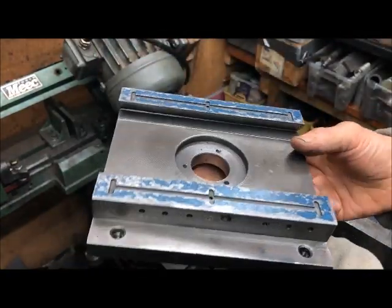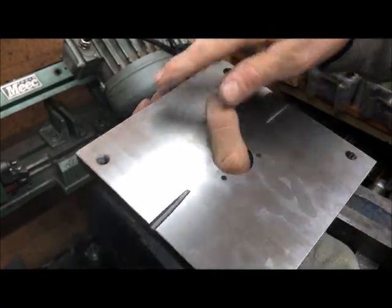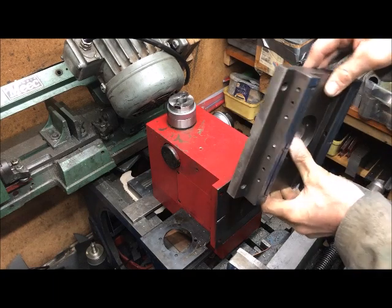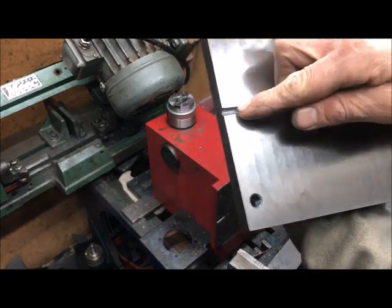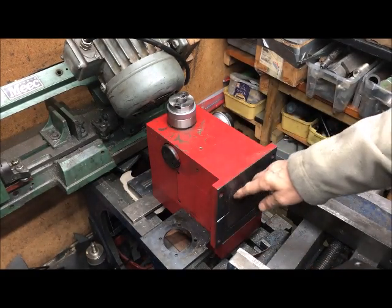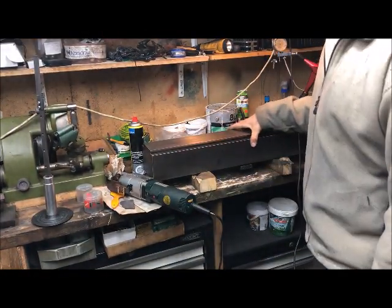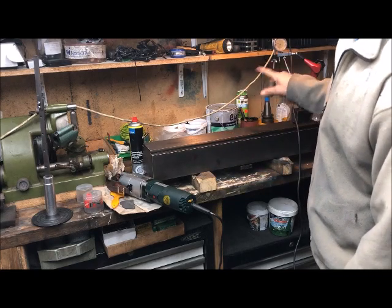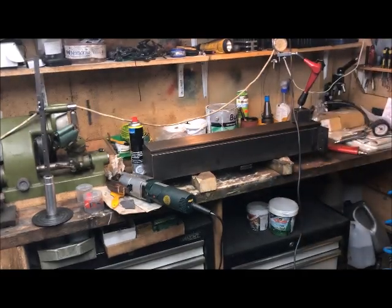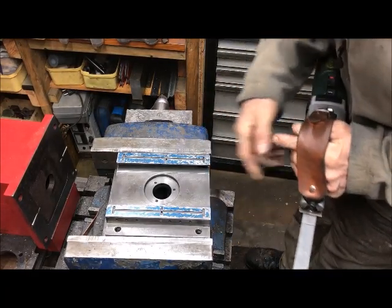I had to scrape it down here and that's now been fixed. I've since proven that it's flat. The piece here will fit like this to the head with taper pins and slots machined in. This again mounts to set axis - put on here and measure with the head and the saddle on to verify that everything is correct afterwards.